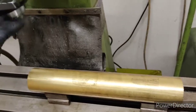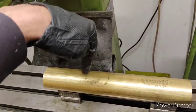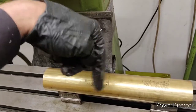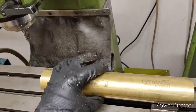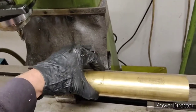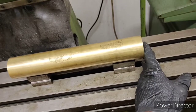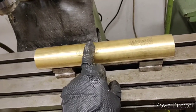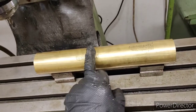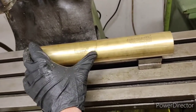So what I'm going to do is take the milling machine, put a cutter in it, to actually start cutting the trunnions first and machining them in. The trunnions are for what the carriage holds the gun. This being the muzzle end, I'm going to start machining the trunnion holes or protrusions about 160mm in — that leaves 140mm in the back.